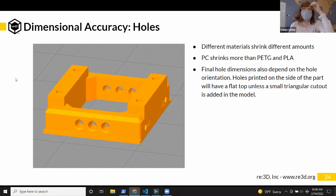In practice, holes are usually for screws or heat-set inserts, and we don't use many screws larger than M5 — all those holes are small enough that they don't need support. It's also important to think about how the hole interacts with the screw: is it supposed to be a tight fit where you're threading into the part, or should it be loose so the screw passes through easily? You may have to add extra tolerance in your model. For a part printed in polycarbonate versus PLA or PETG, you may need to make the hole diameter larger because polycarbonate will shrink and the actual printed hole will be smaller.